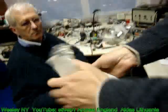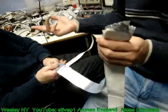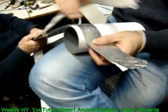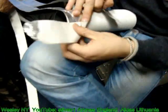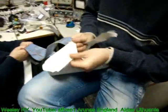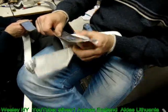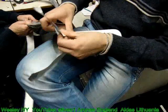In this part, we see coil capacitor. Actually, how to wind the coil capacitor from the aluminium tape. It's insulated with the paper. We use additional foil. That is a scotch tape, very heavy duty, used for the parcels. Now, this is just the experiment showing how to wind it. We did not show in here how we put a foil in between.